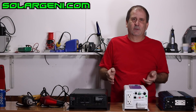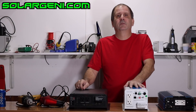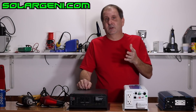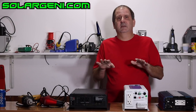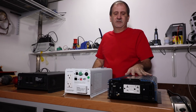If you want to run an air conditioner, charge your battery bank, and run heavy-duty tools all the time, then you want a low-frequency inverter. They're heavier and cost more money, but they'll charge your batteries as long as you're connected to the grid or an AC power source like a generator. If you're just going to run light bulbs or low loads, a standard high-frequency inverter is fine.